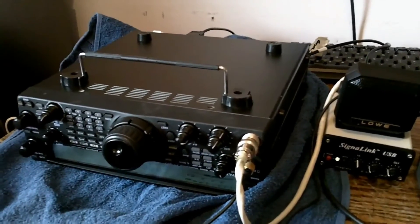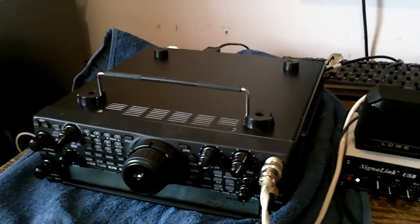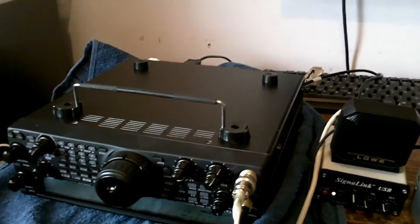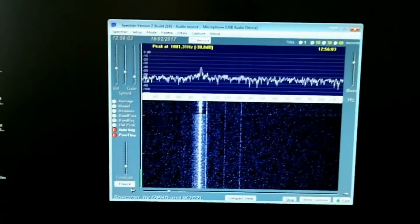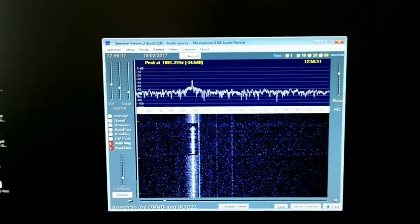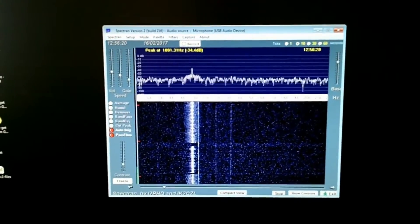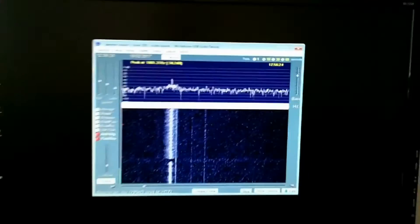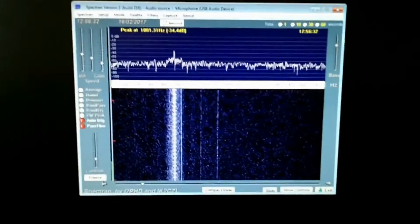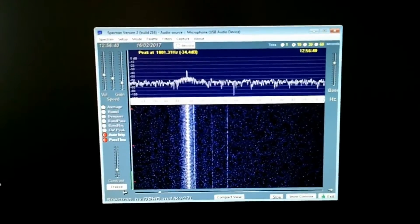Touching the crystal, my body temperature didn't seem to adjust it very much. So I put the lid back on and adjusted the local oscillator — the master oscillator — so that the readout on four metres is now 1001.31 Hz, which is 1.31 Hz above the ideal. There's no way I can turn that little trimmer any more finely than that, so I'm going to leave this for an hour now with the case on — albeit upside down — and just see whether that moves at all, or by how much it moves.